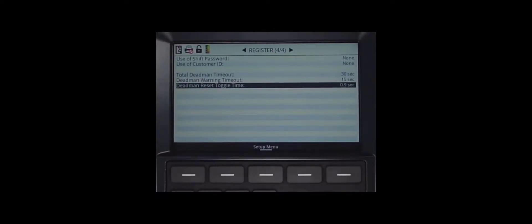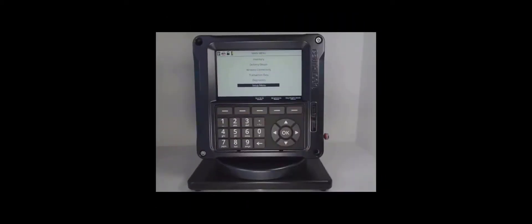For the purpose of this demonstration, I'm going to shorten up these timers. I'm going to reduce the Total Deadman Timeout from 120 seconds to just 30 seconds, and also reduce the Deadman Warning Timer to just 15 seconds. This means that once I engage the Deadman handle, the timer will start, and after 15 seconds it will enter the warning period, and after 30 seconds it will pause the delivery. Now that we have our timer settings adjusted, we can return back to the main menu by pressing the setup menu button, then the main menu button. To get back to delivery mode, we need to exit calibration — locate the bolt on the side of the register and rotate it back into the housing clockwise until snug. If you have a ticket printer connected, it will print a calibration ticket; if not, just press the abort print button. Then press the home button to get back to the delivery status idle screen.